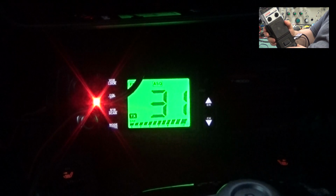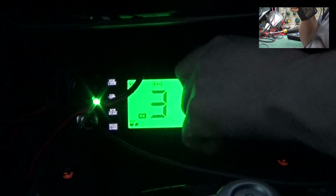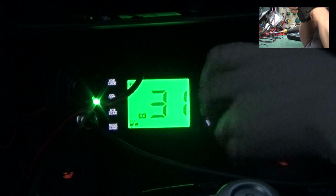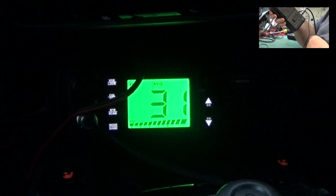Tango 21 from Mr Chippie, we're now at the 5.5 mile point. Roger, got you at the 5.5 mile point. So on this Harvard WT44, doing 3.1 watts, drawing 575 milliamps, got low power, which I've set to 400 milliwatts, and then flick it down now, 54321, and here I am now on 400 milliwatts. Back to full power, and there we go, over. Yep, Roger, that was all received.